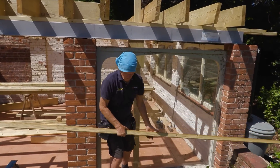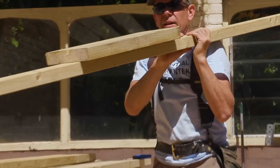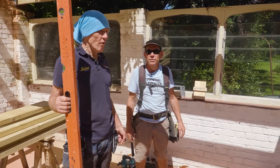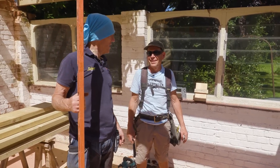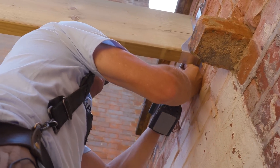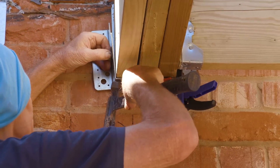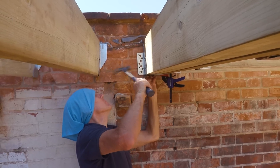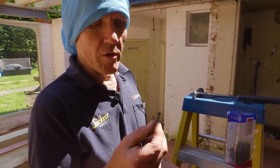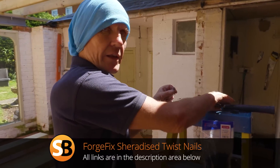There's a reason why we screwed them on — I don't want to cut the timbers in half yet. I want to keep these at full length. I've got to say, mate — that's pretty good. It's level all round, in all four planes. I can't even get a shower tray in that level. If you're putting joist hangers in as a DIYer and you think you can do that, don't use galvanised straight nails — use these square nails which have been twisted. When they go in, they take a lot of getting out if you ever have to remove them.